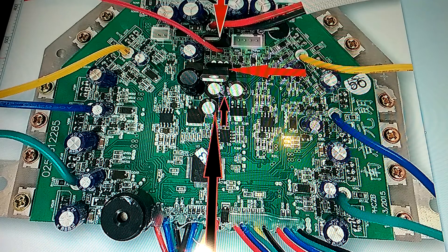This is a short video to identify what components go bad when your hoverboard fails to turn off. As you can see, there are two transistors on the top of the board and they're both TIP-127 Darlington transistors. These are the most likely culprits for your hoverboard not being able to turn off.